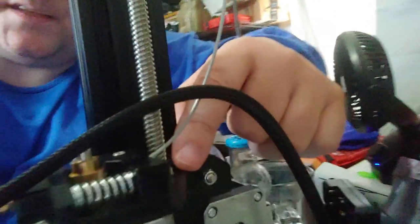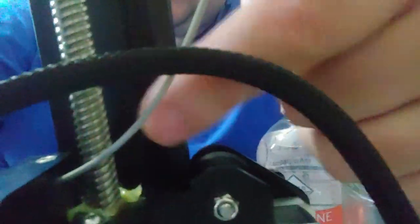Exact same G-code. I did not change the G-code, I did not re-slice. All I did was reprint after I got rid of that force vector shift. The bushing inside here was tight and out of place, applying force to the lead screw because the lead screw is not perfectly straight — they're almost never perfectly straight. The solution was to loosen those two screws holding that bushing in place, run the axis up and down to let it find its center, then snug them — don't tighten them, just snug them.